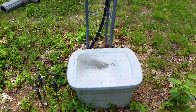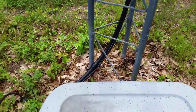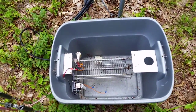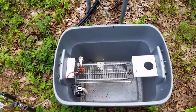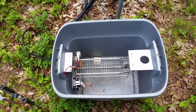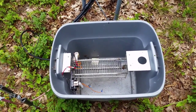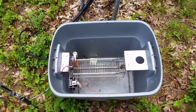This box has been out here for eight years now, so pardon a little bit of dirt inside and out. I'll open this up and you can see the capacitor used for the gamma match on 160. There are some extra components in here — a relay and a couple of fixed capacitors. This was a dual-band feed, 160 and 80, but after I cut down the trees that were in close proximity to the tower, it no longer wanted to work on 80. A very interesting thing I discovered there. So now it's only used on 160.